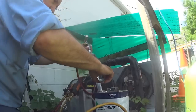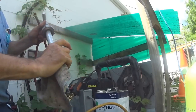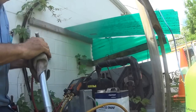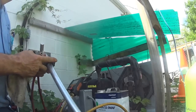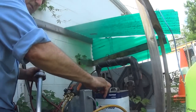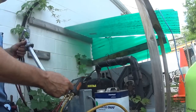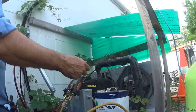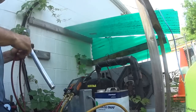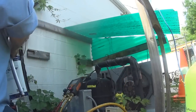Let's clean off our pump. This is a good pump — it's made by Thermal, a company named Thermal. I've been using these since the 70s, they're really good. They make a vacuum pump also that I have if I'm working on a semi-hermetic Copeland unit. It's got a plastic tube coming off the bottom — I take the plug off the Copeland semi-hermetic, put the tube right into the oil, and drain it out. Works very good.